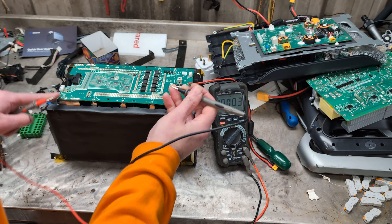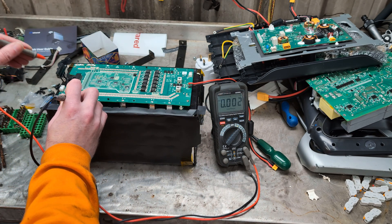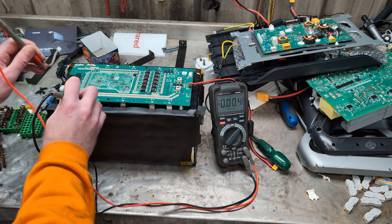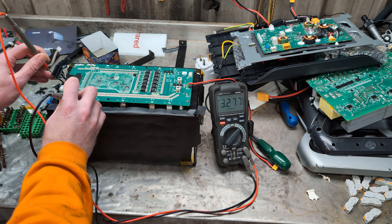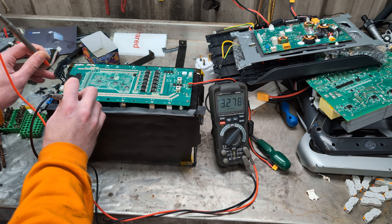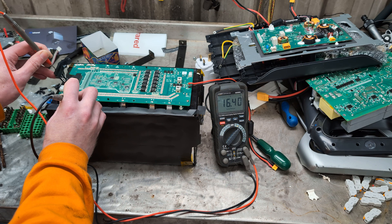If I take this and put it on the one marked battery negative — there are eight white wires and eight black wires. Starting at the low end on the white wires, we've got 3.3 volts, 3.278. And then it goes nine, which is not double three. And then it goes 16, which is not that either.